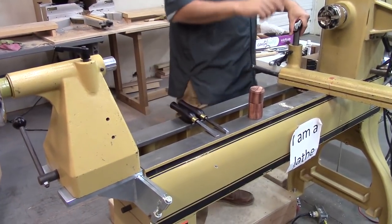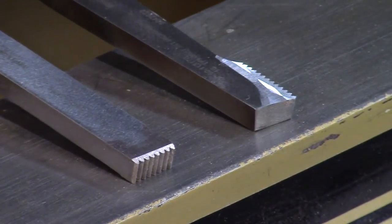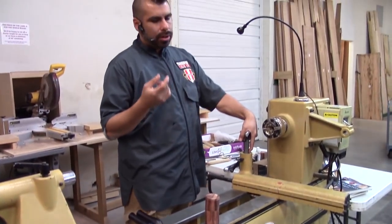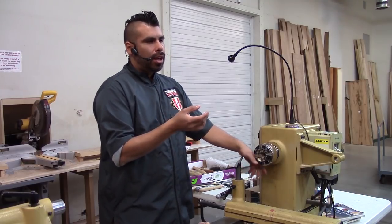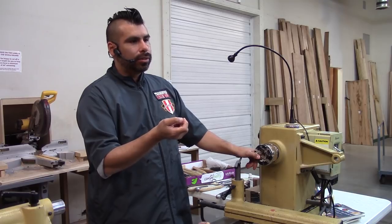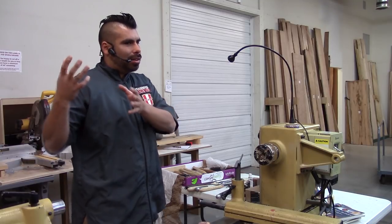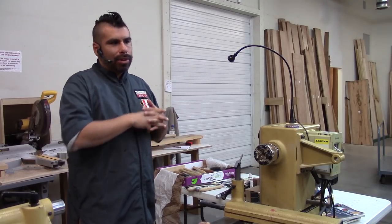I'm going to demonstrate with number 16. I know that the Woodturners Catalog sells the 16 and the 20 TPI. I wish they sold more sizes, because I love threading on different sizes. But there's another place where you can find thread chasers. You can go to eBay, and there are a lot of guys in the UK that sell chasers and handled chasers. Sometimes you will find them in lots, like a lot of 60 chasers, but it will be a mix and match. But it's okay, because it's like a $70 lot of 60 chasers, and then you can mix and match and get rid of the rest.